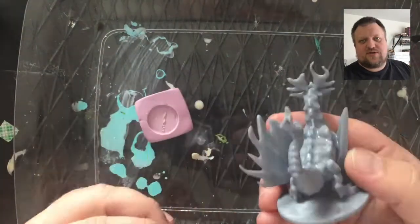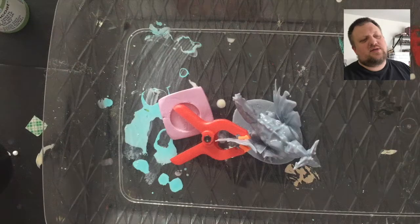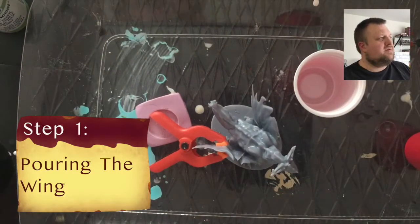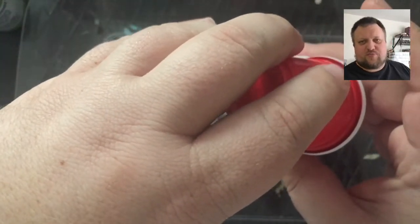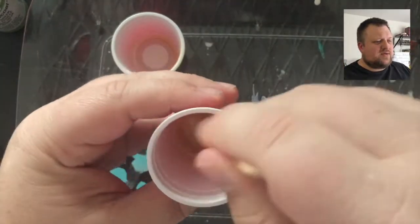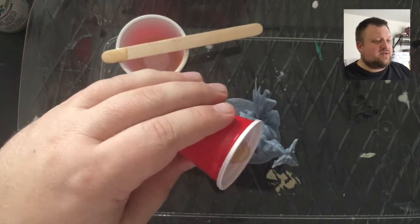It's got a wing that printed on the supports but not attached to the dragon, so there's some warping there. And before I brought it back to the workshop it had been mishandled and a couple of the horns had broken off the head. So this is going to be a two-purpose video: we're going to be pouring plastic to hold the wing and fill the gap — it's not a flush break, just warped 3D print — and then we're going to be press mold casting the horns by making an exact copy of the two horns that are still in place.